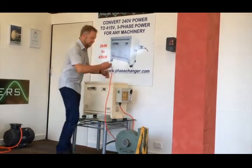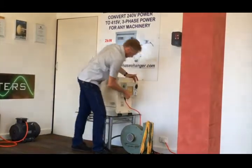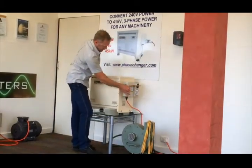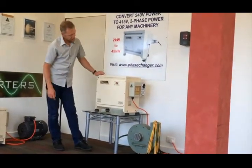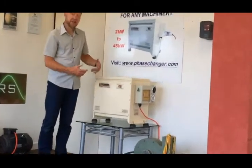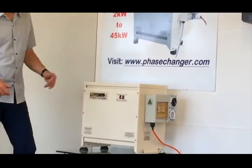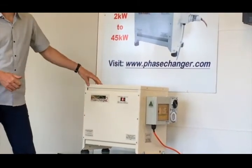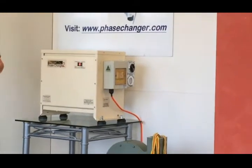We're going to start this unit up and have a look at the panel. I've got a display here, and I'll turn it on. Wait for a few seconds. You'll see that momentary flash-up to wake, a couple of clicks. The unit is now running — that's the noise that comes out of it. We've got a pilot motor internally; it doesn't have a shaft on it, it just sits there and works effectively as a rotary transformer.